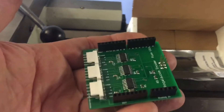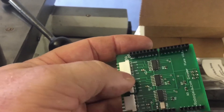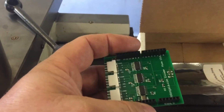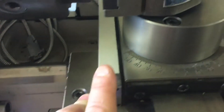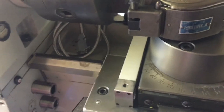This arrived to me this week — it's an encoder board which allows the DRO scales to be plugged in. It has an A, B and index channel for each of three scales. There's a counter chip that does all the quadrature encoding and counting, and there's a serial interface out, so I can basically query the position and it maintains a record of position. The Eason scale has an index mark every 50 millimeters, whereas the other scales I was playing with have just one index mark — useful for absolute positioning, whereas this is better for confirmation of position.